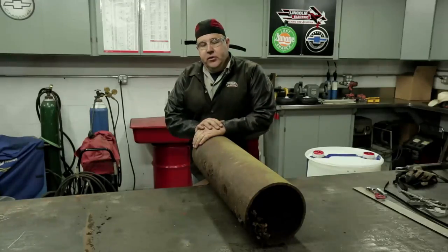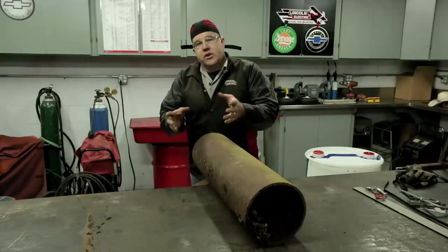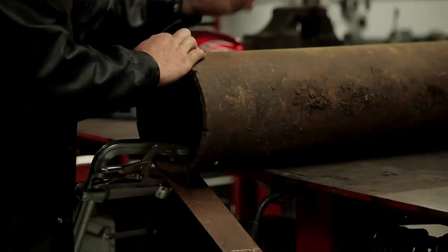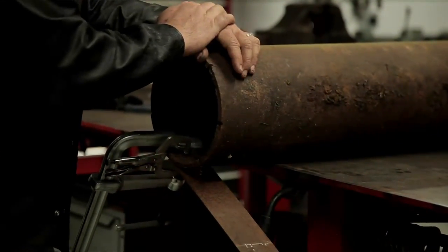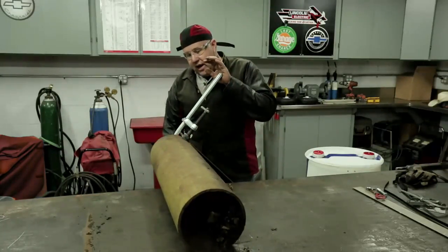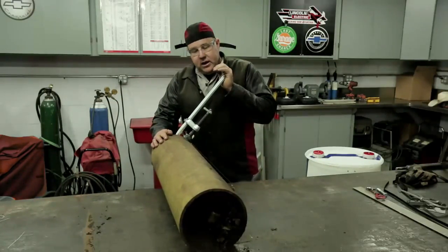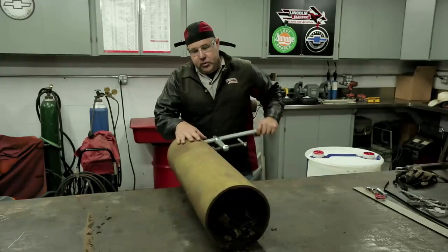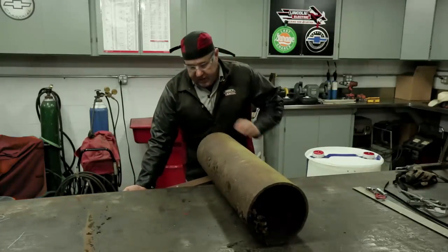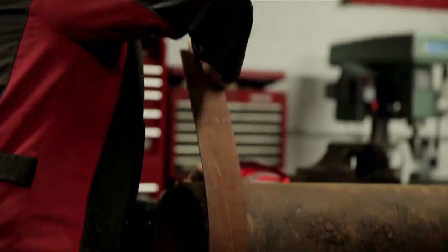I had a little issue coming up with how I was going to build those curves. Here's how I did it. Those little pieces are 8 inches long apiece, so that gives me about 16 inches. I cut this piece — I think it's about 20 or 24 inches long — and I've just clamped it to the pipe. I've also added, let me turn it so you can see it, just a giant clamp. This could be a bar clamp, or even a pair of channel locks. That gives me something to hold the pipe with. We're just going to grab hold of it — I've got the clamp against my leg — and I'm just going to bend this up and around, keep working it until I bend it all the way over.